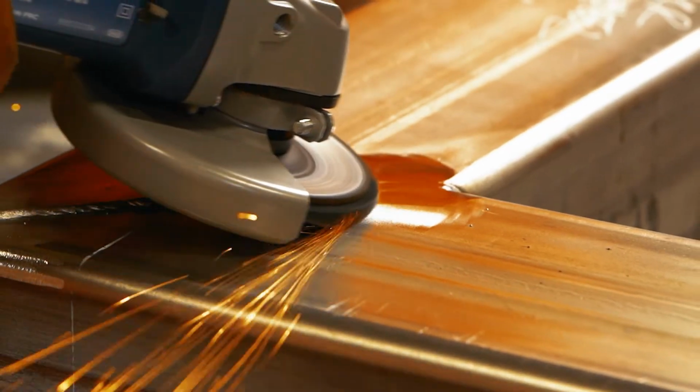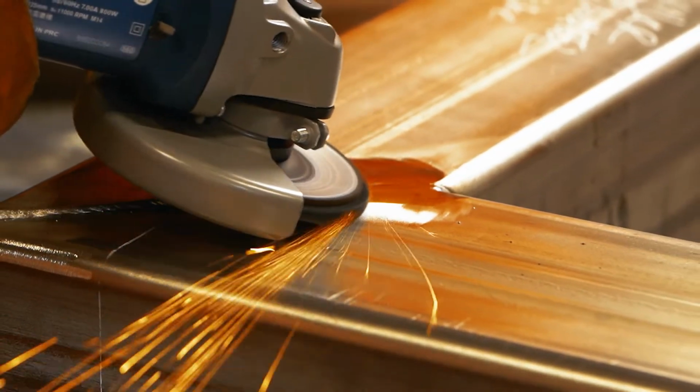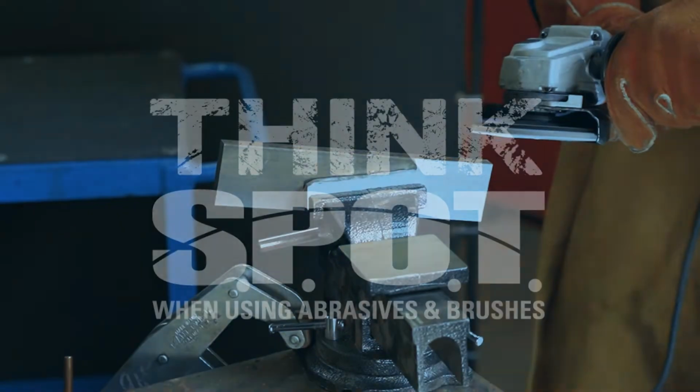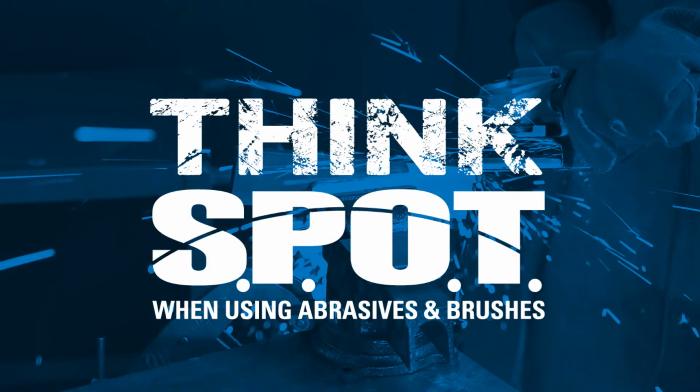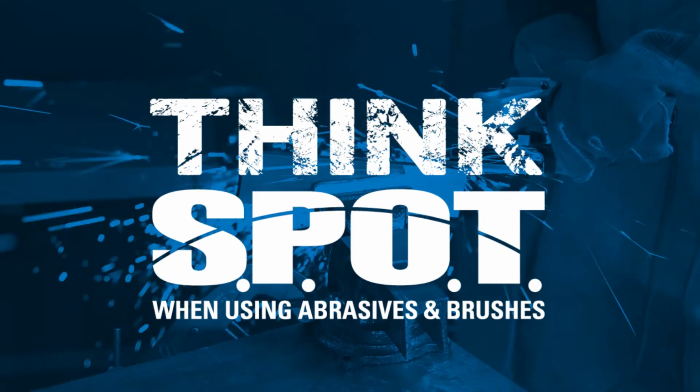Remember the key factors under your control that limit the potential for injury when using coated abrasives: speed and size, pressure, orientation, and time. Think SPOT.